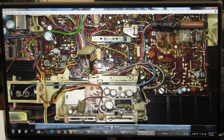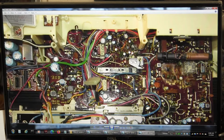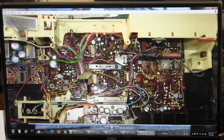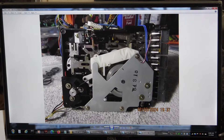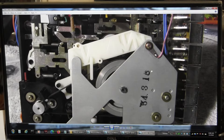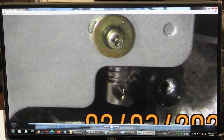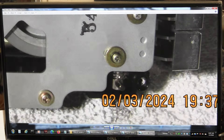Here's just an overview of the underside of the tape deck without the tape deck in place, so you can see the recording bar switch and the lever that actuates it. This is the underside of the tape deck as it is. Do not remove these two screws — they go to your solenoid, just leave them in there. But I did remove them because I didn't know. You don't have to take these out; just be mindful of the spring and the plunger — don't lose the spring and you'll be golden.